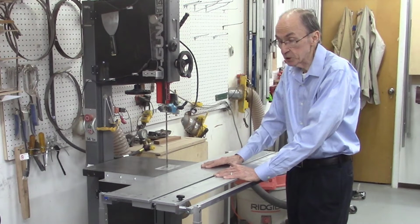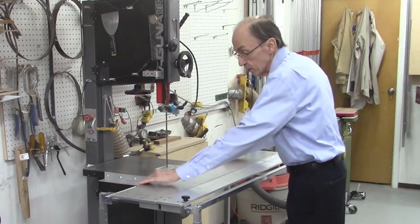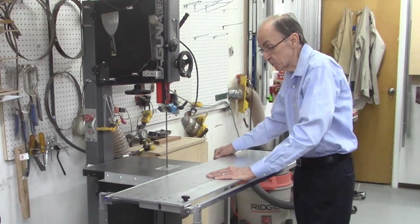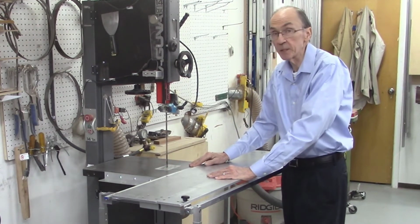Overall, the frame is much sturdier than our previous system. This larger front bar gives it more stability, and the guide bar is actually mounted with 4 screws to hold it firmly in place on the ends of the guide bars. So that's definitely much more stable. And this guide bar can be changed to other guide bars with different dimensions that will fit in other bandsaws.